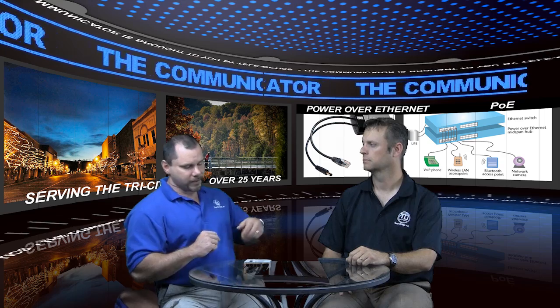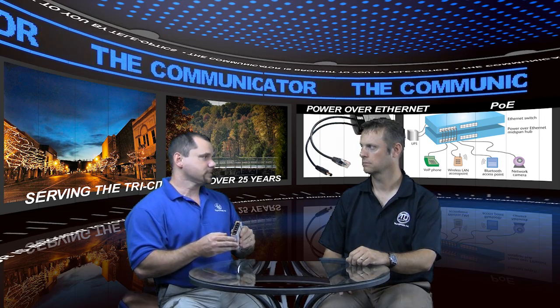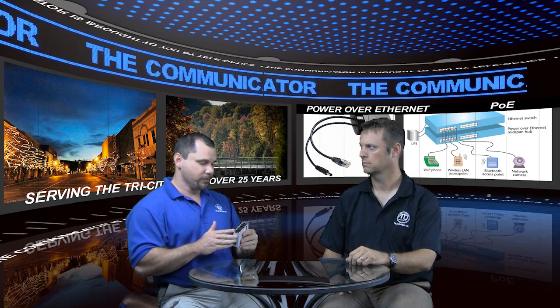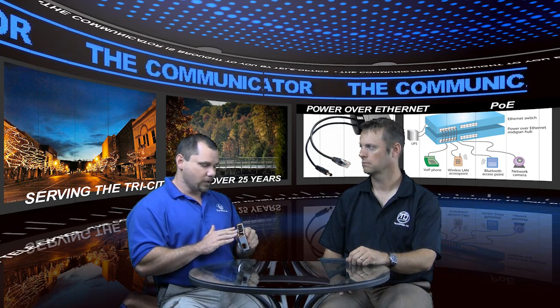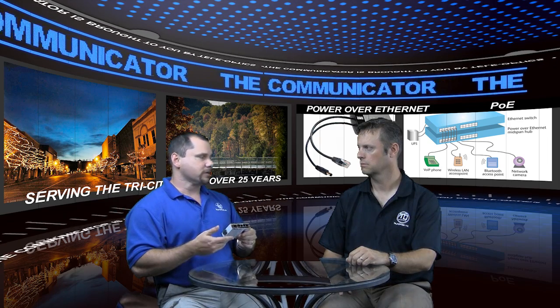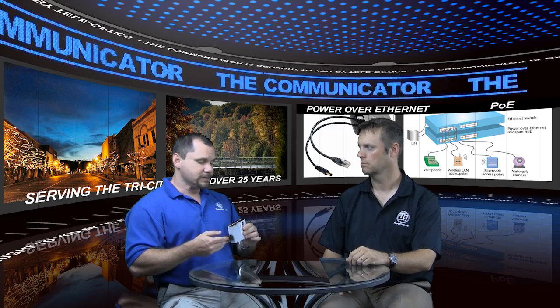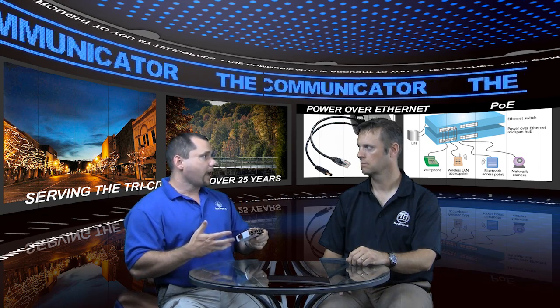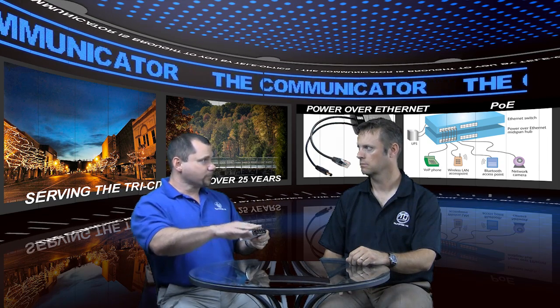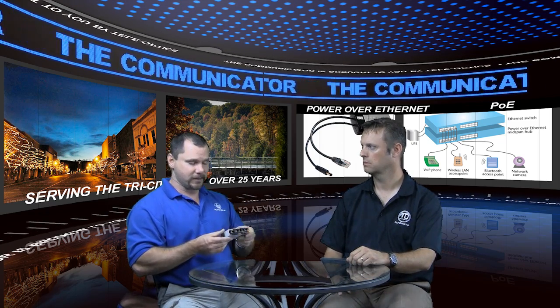There are times you'll scale it up. You may use one of these — this is an industrial PoE switch. It's got five ports on it, one of which is your input port, giving you four ports of power over Ethernet. Being industrial, it can handle industrial atmospherics such as really hot heat, really cold, things like that. We've put these in boxes and buried them out in the field — for example, extending out to two cameras on a pole — and these switches will actually survive that.